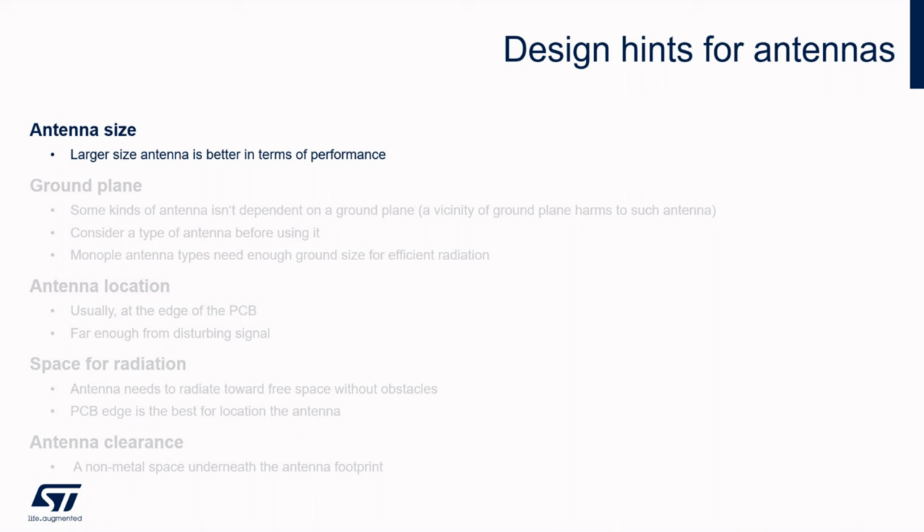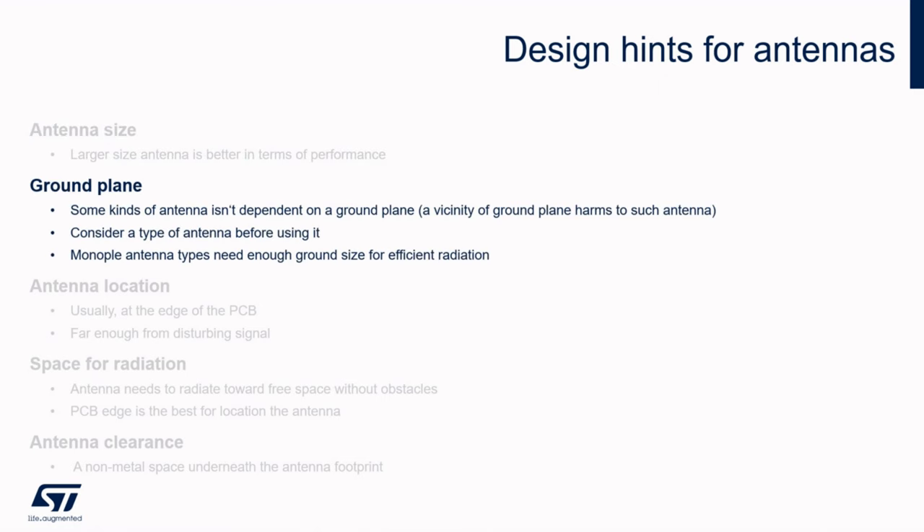With the size of the antenna, the size of the ground plane relates as well. In many cases, the type of antenna used requires a sufficient surface of ground plane. In other words, you cannot use a monopole antenna on a PCB surface which is smaller than the antenna itself. The antenna needs space where to radiate — it is mostly at the edge of the PCB. Only in a couple of cases for some antenna types should you consider placing the antenna in the middle of the PCB. There is mostly no possibility to put the antenna so that it would be above the ground plane; it is almost always in the same plane as the ground plane. It should be our concern to make the ground as large and as visible for the antenna as possible.